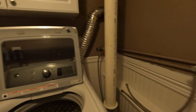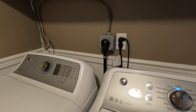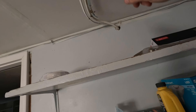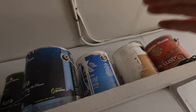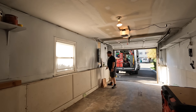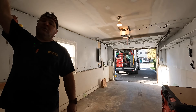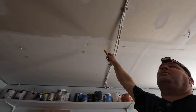I wanted to show you just how terrible of an installation this was. There's your dryer line in the laundry room. We're going to cut the circuit right here and somewhere over here, and we're going to mount two junction boxes in a spot that's accessible. This one is obviously the dryer because we saw it, so we'll turn that one off, but we don't know where the other one is.